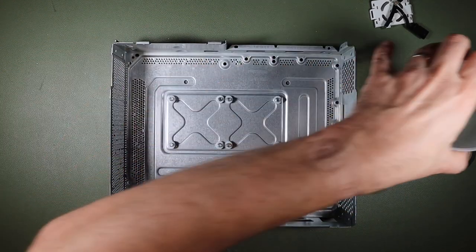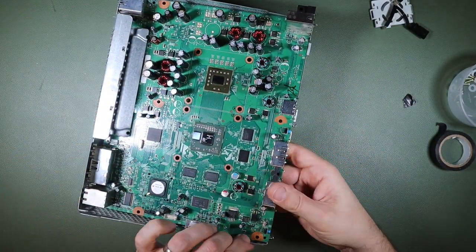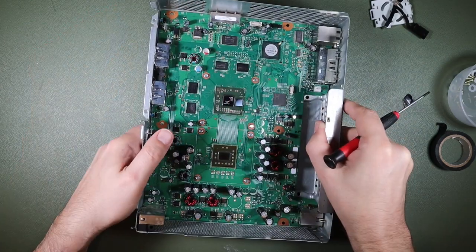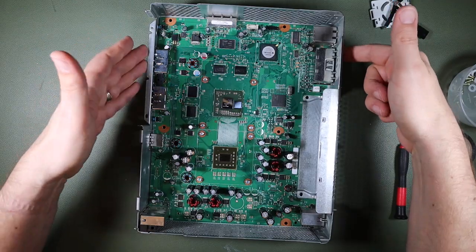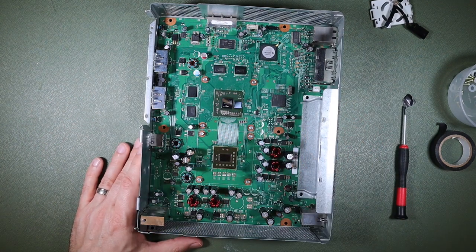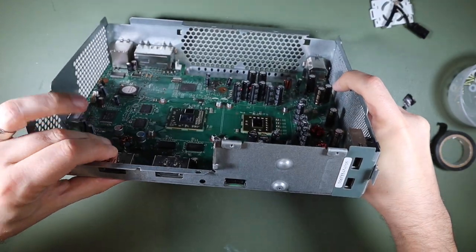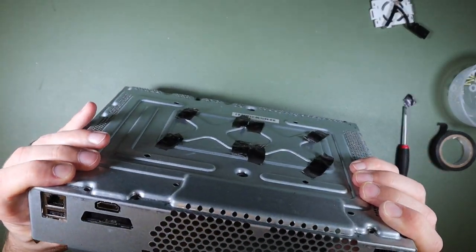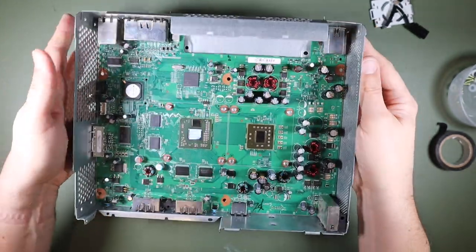Now I've got those in place, I'm going to go ahead and put the printed circuit assembly back in. I want to come down straight onto those screws so I don't push them out of place. I'll go around the other side to check my tape and check the alignment of all the sockets around the board. It looks like all the LEDs, sockets and everything else are in the right place — the HDMI is very central to that HDMI hole. So I think I've got the right number of washers and I'm going to go ahead and reassemble.